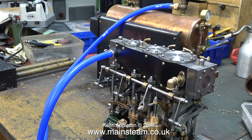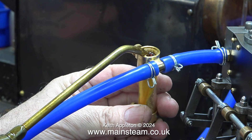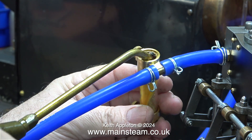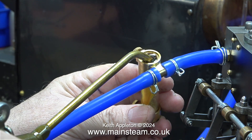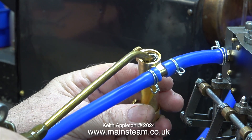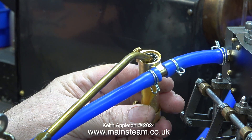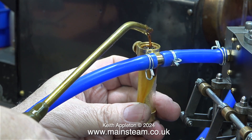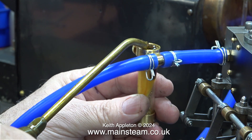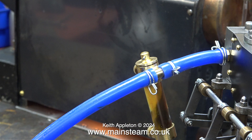I'm still figuring out the layout of the steam plant in my head. This is the live steam test, so it's very important to make sure the engine gets a lubrication supply. For this I'm using a very useful Microcosm displacement lubricator with a glass middle section so you can see how much oil is in it. Because it's cold in the workshop, the steam oil is very thick and gloopy and the parts are cold, so I had to be patient until sufficient oil ran down the inside of the glass. I didn't need to fill it all the way to the top.